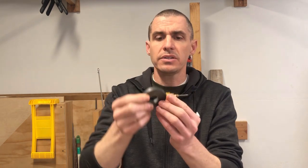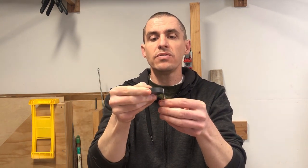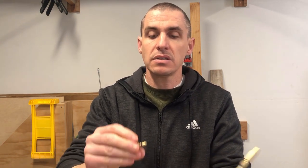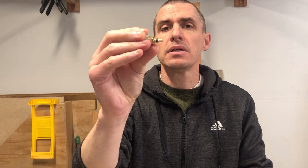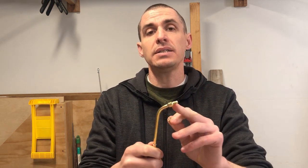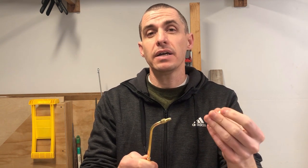The bits that are not brass and are ferrous are the retention nuts for the needle valves, on the oxygen side. The needle itself on the oxygen side is mildly ferrous, so I'm not sure what it's made of — but it's on the oxygen side so that's not an issue. The fuel side is all brass other than that retention nut. On the inside, the needle part is brass and has no magnetism.